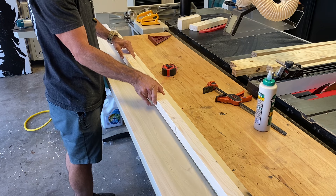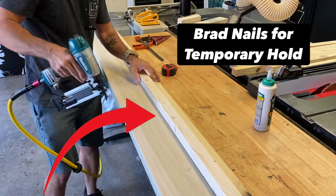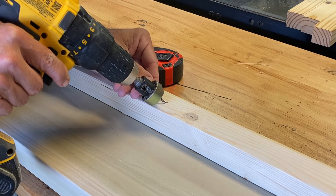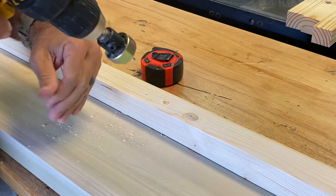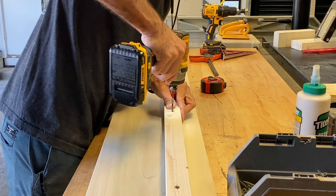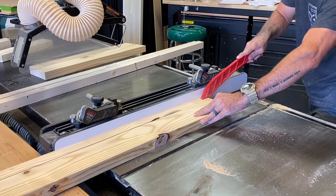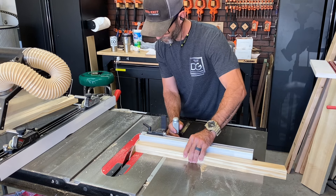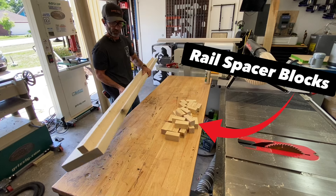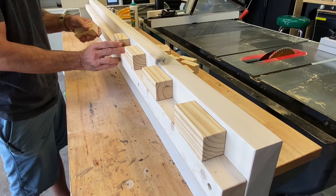I'll have DIY plans for this king size bed in the description box below — or they will come shortly, as I'm still wrapping up the plans on the Adirondack chairs from last week's video. I used brad nails to temporarily hold this board in place instead of clamps, then marked out recessed holes and attached it with real support screws. Now I'm making cuts and attaching all the support spacer blocks for the slats. This step is optional, but over the years making beds I've found it's much easier, especially on setup, and it structurally makes the bed better as each slat will be evenly spaced and supportive.